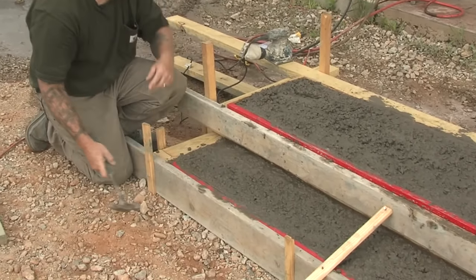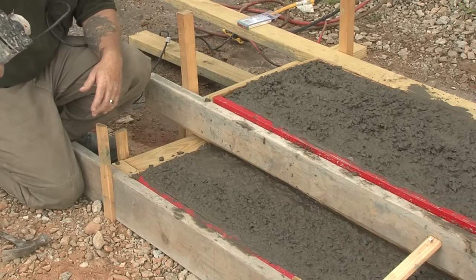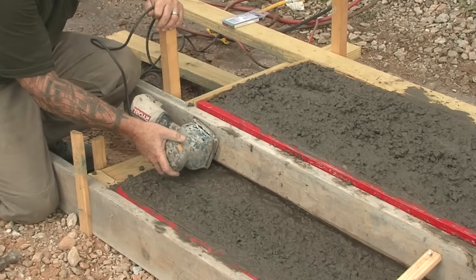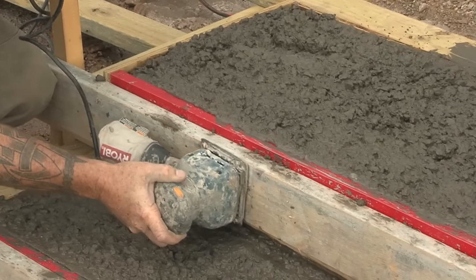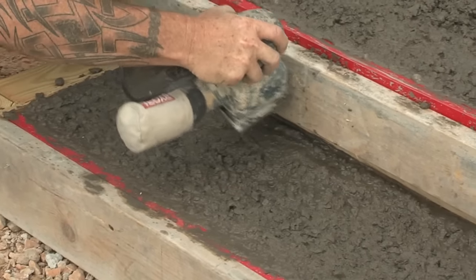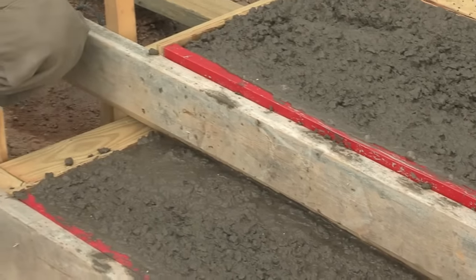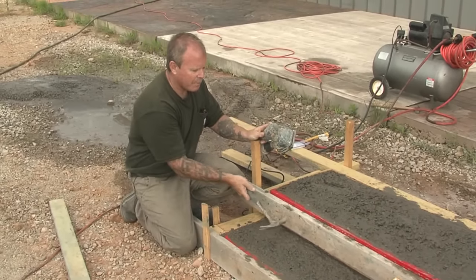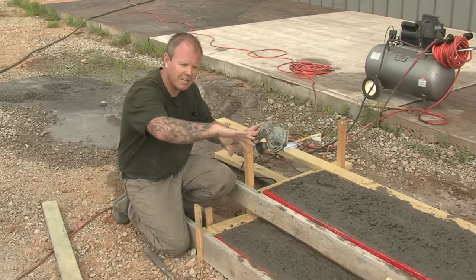You notice the paste that's coming up. Another good way to do this is to use just a palm sander. We use this a lot on concrete countertops to really vibrate — watch what happens to the edge when we use something like this. Regardless of whether you use a palm sander or tap it, don't skip this very important step, because this is really the key to getting a nice textured edge when the forms are removed.